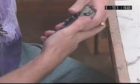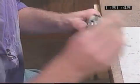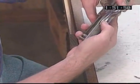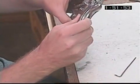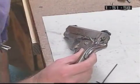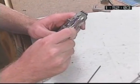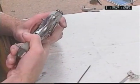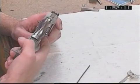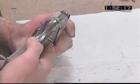Should be real close this time. Okay, it's not hitting the grip safety at all. We've got travel there. Now you need to check to see if it'll actually work when you pull the trigger. When you pull the trigger down, it's up there, it's blocking the trigger just like it should. I've got the safety off of it. Pull the trigger, nothing happens with it.